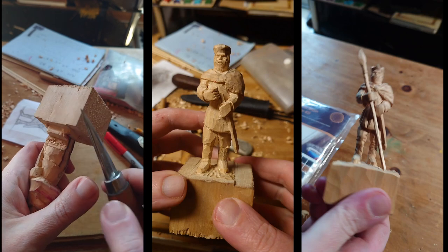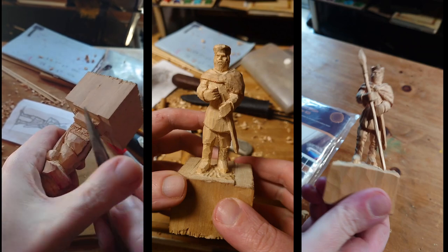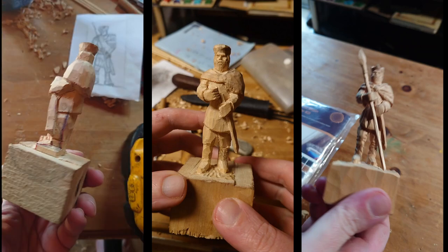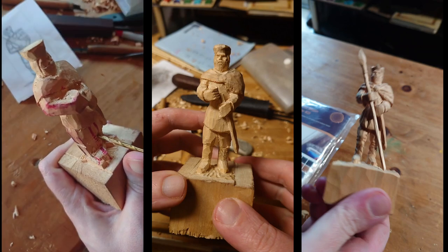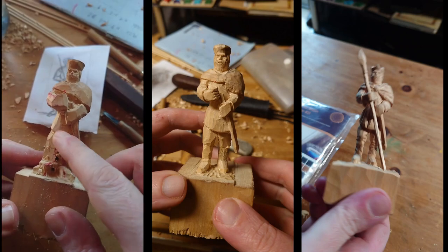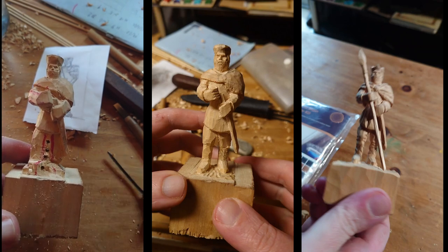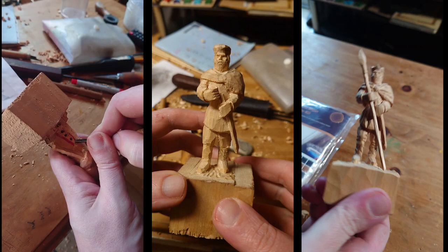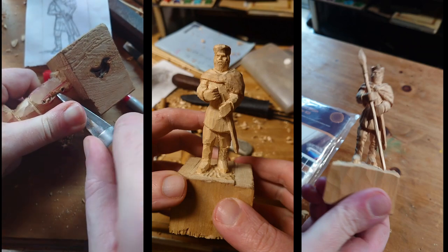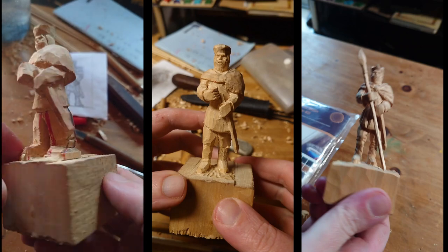Another type of cut that I do in tight situations is to first push down with one thumb and then use the other thumb to help pull the blade. To make the gap between the legs I'm just going to use a drill — of course that hasn't done all the work but it's helped me a lot in finding where the center line is. So now I can come in with a little gouge or with a knife in here. Eventually you'll work your way through and probably make a rough-looking gap, and then you can start planning the legs in a bit more detail.